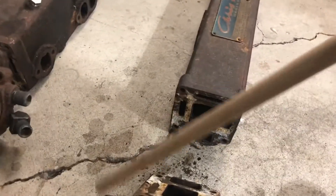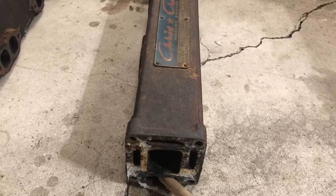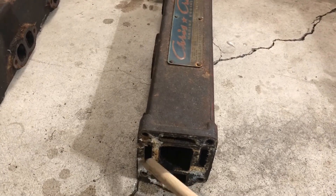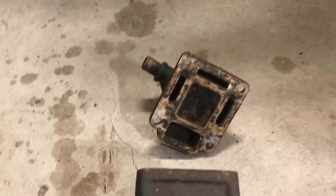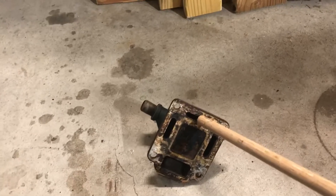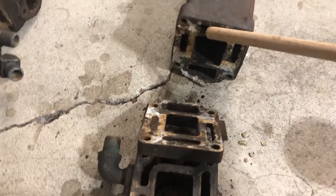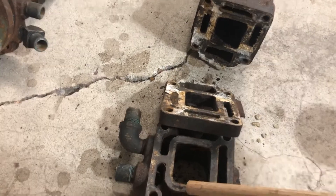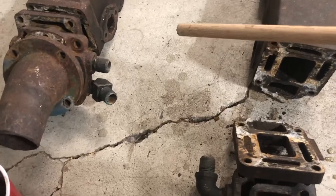When the water comes in this nozzle, it enters the bottom port here and flows through these two areas to this end of the manifold. This distribution plate collects the water and diverts it into the top port, so the water is returned along the top port here. Then these distribution plates allow the water to exit through this nozzle into the engine block.